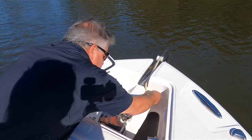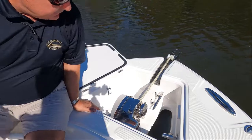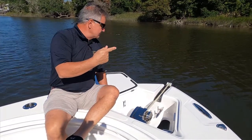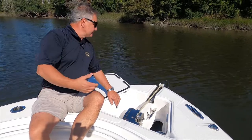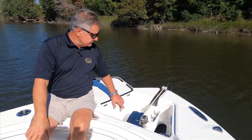For this demonstration I'm going to untie this now. I have a pilot on the boat — John, go ahead and gently put the boat forward and watch my hand signals. It's always easier when you have two people. John the helmsman is going to go forward a little bit and I'll give him a simple hand signal. What I'm doing is using the boat to get up over the anchor, and then as he does that I'm going to press the button. The windlass and gypsy are going to engage and start bringing the line in. You want the anchor line directly straight down when you go to pull it all the way up — that makes the anchor easier to release.